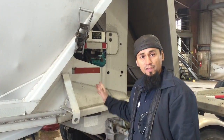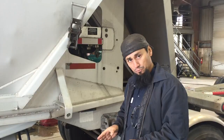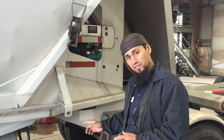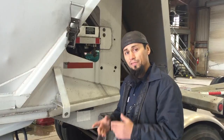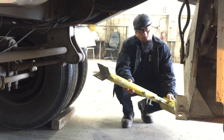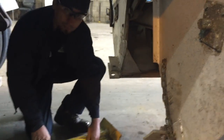At this point, the trailer gate is energized with air. So before we put our guards in, at this point we are energized. So note at this point that you do not want your hands or your head in the no zones, because if anything is present in the no zones and an accidental close, that's when you can get harmed. Okay, first step of the procedure is to install one side of the gate guard. Pull the safety pin out of place.